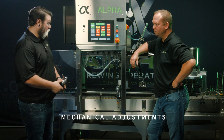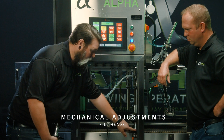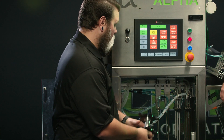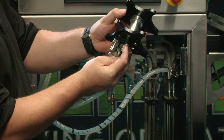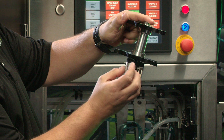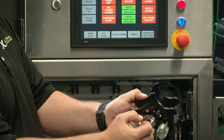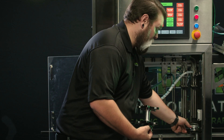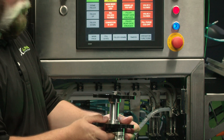Mechanical adjustments for your filler start with the gate. The gate is mounted and has a pin that stops your cans in the proper position, centered with the fill head. If you need to adjust the position at which it stops, loosen the nut on the bottom side of the gate, which allows you to rotate where the pin is in relationship to the conveyor. You also have in-and-out adjustment on that bracket. Once you find the place that allows the can to stop in the proper position, tighten that nut down and ensure it hasn't moved.